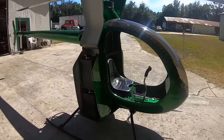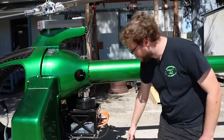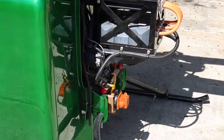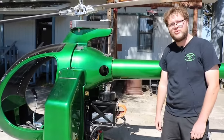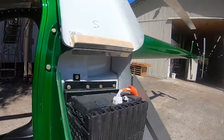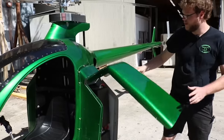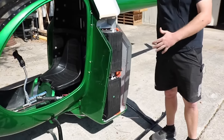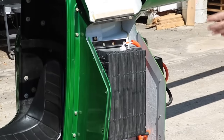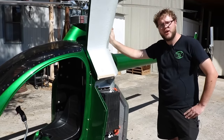We have all of our bus bars down here, some pre-charge circuitry, and this down here is not a charging port — that's our safety plug. We can use that to isolate the battery pack if we need to get into the packs themselves. Norbert said earlier we got two on each side and one underneath. These are LG Chem cells — about 3.5 kilowatt-hour each.